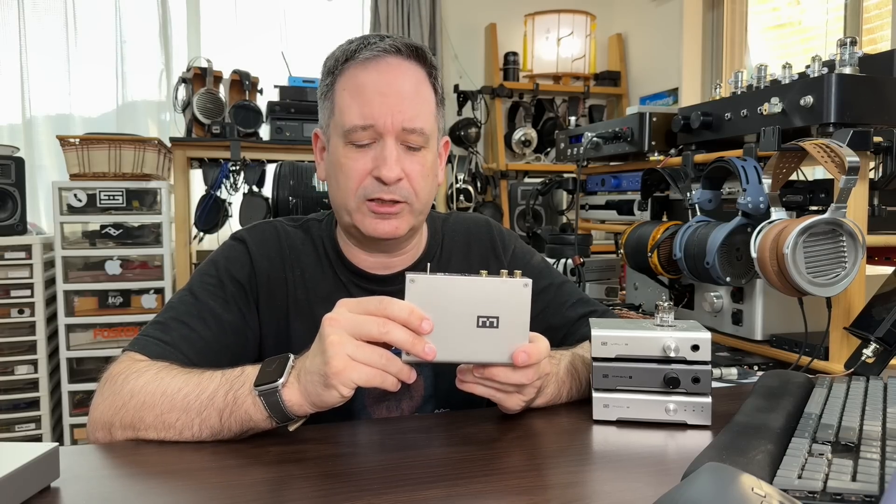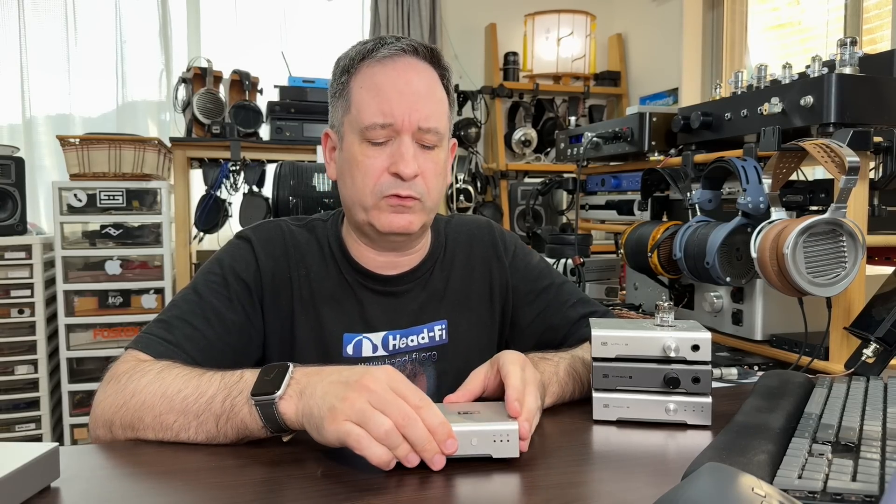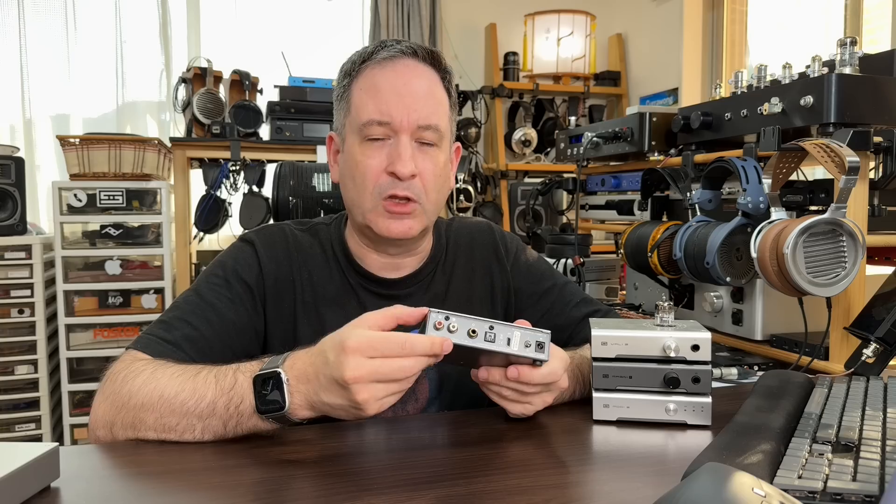You also get not a switching wall wart but a transformer wall wart, as the input is AC. In this DAC there is a linear power supply, at least for the analog and digital components — there is a tiny switching power supply for the controller. So it ticks a lot of boxes for me in terms of what's inside it, as I'm not a huge fan of switching power supplies due to their long-term reliability. Hopefully this, at least the controller part, will last for a long time.